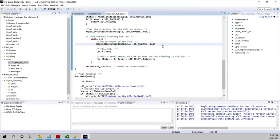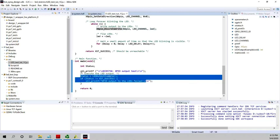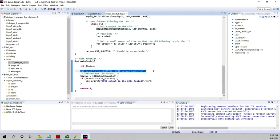On top of that, this function here, because it is executed here, before doing that, I am gonna print a message. So now when we execute the command printf right here, what would happen is it will be printed on the UART. Printed, I guess, quote unquote, printed on a serial port using the UART. Of course, the UART is a very old communication protocol, but it is implemented in your board, right, using the USB connector. So that should be all.